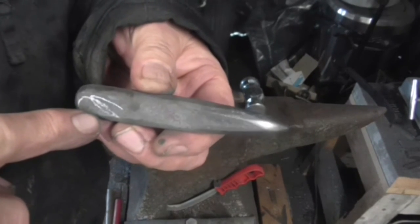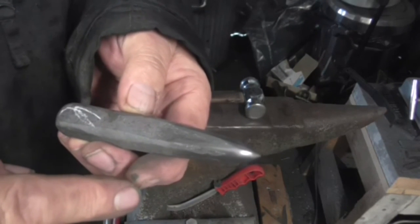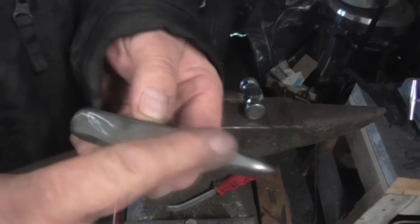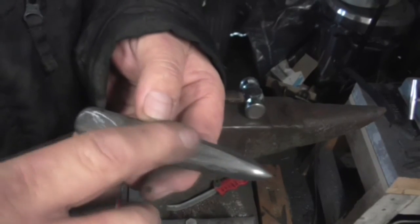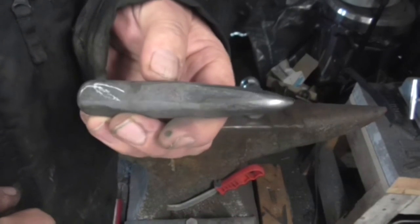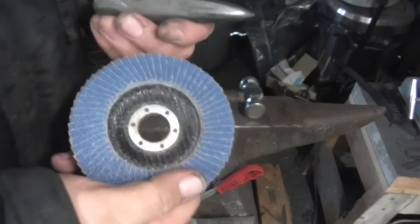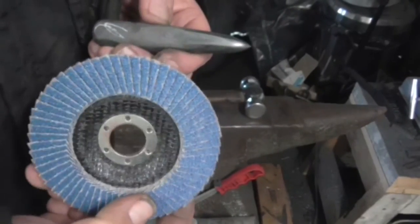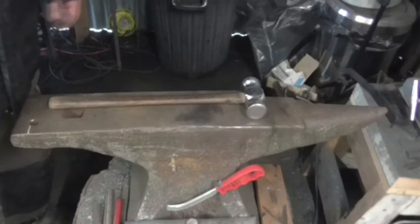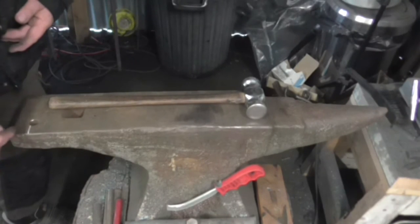I've cunningly marked the face that I've polished with chalk. Once it's been heated to non-magnetic, you're supposed to re-polish the tip with a broken piece of grindstone or something like that. I haven't got any broken grindstone, so I'm not about to break one just for this. So I'm going to try using an abrasive wheel, just handheld — this brand new one, so it should have pretty strong abrasive qualities. I've also cunningly marked 30mm on the end of my anvil, on the edge, so I know what that looks like when I come to quench the tip.